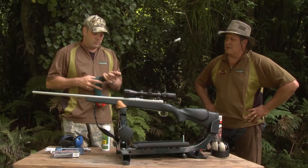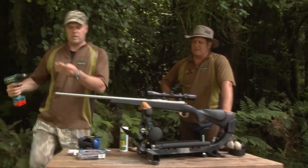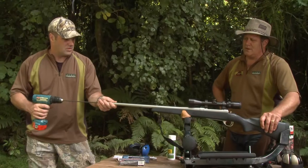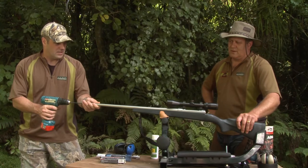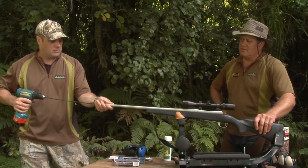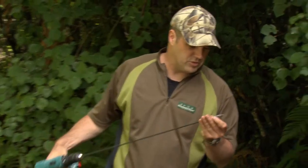The other way — we'll hook that into our drill. A little bit of autosol on there, coming to the end of the barrel. We just work it right down the end and keep on doing this until the same results happen. You see all the dirt? We keep on doing it until all the dirt comes off. Make sure the barrel's nice and clean. Just keep on polishing the barrel up with autosol — it's as simple as that.